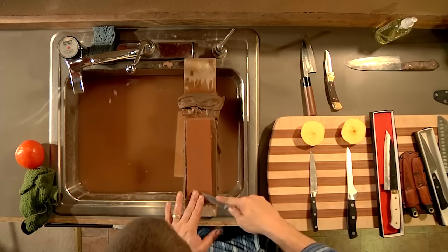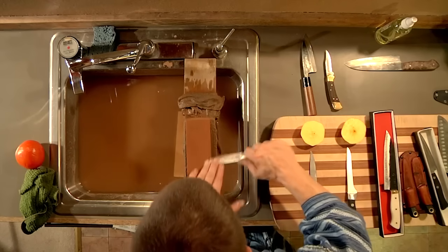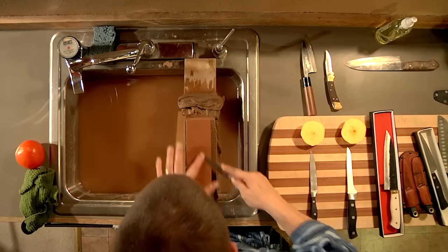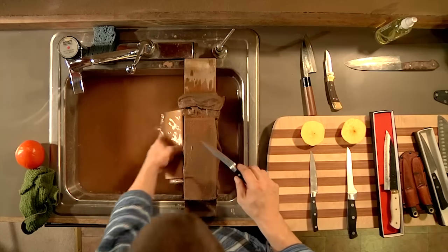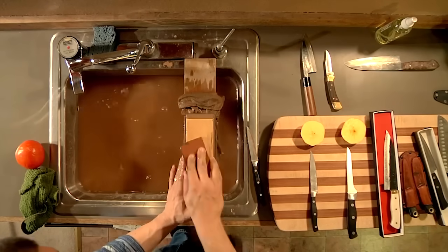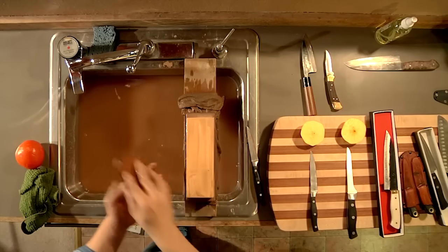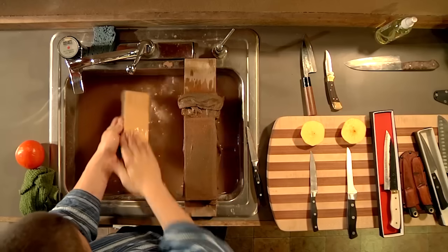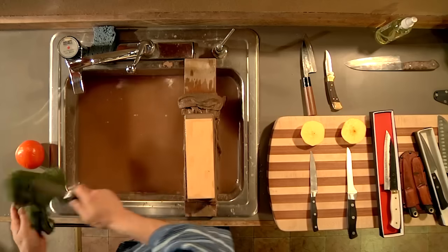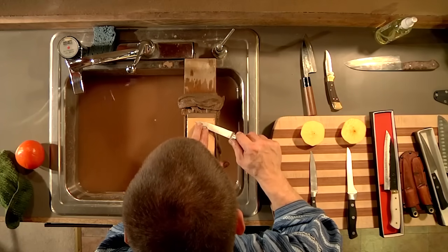Another thing I can do here, and we'll show you on the finish 6,000 grit stone, according to the 7th step, is we'll actually watch a trail of metal come off on the stone. There we go. Watch as I transition to this stone. Let me clean it off for you so we get a real clear view of what's happening. There we go. Okay. Now watch carefully. As I draw this stone backwards, watch where you can see the metal.